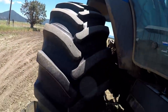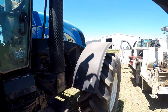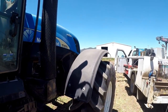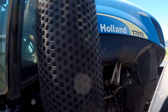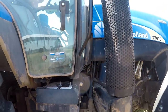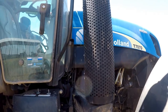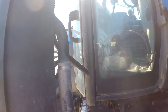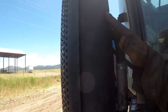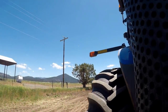Boy, it's just a bad design, really. There's nothing supporting that thing. Absolutely no support. There needs to be a brace on the top of that. He wanted me to gusset it somehow, and the only thing I can really see to do, without welding or drilling holes in that cab corner post, is take a piece of angle iron on this shielding here and go up from here to here maybe, to try to help support it. I mean, that's about all I can do.